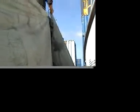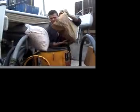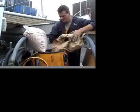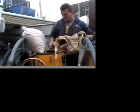The easiest way to remove antifoul is with a professional slurry blast. Your boat will be curtained off to protect your neighbours. Bear in mind that not all boatyards will actually allow slurry blasting on their premises. This is because the slurry, which is a mixture of olivine and sharp sand, is actually very powerful stuff when mixed with water under pressure.